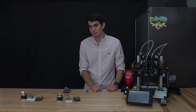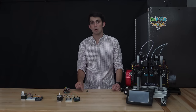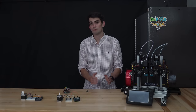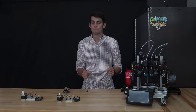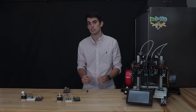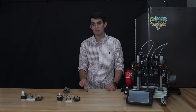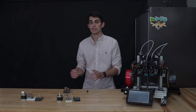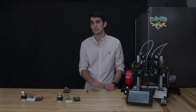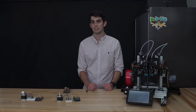Now, this may be a little bit confusing because I had previously said that there were little benefits to these small microsteps. However, the Trinamic stepper driver is performing this interpolation not for the purpose of increasing resolution, but to allow for smoother operation of the stepper motor. Plus, these calculations are done onboard the stepper driver, so this microstepping interpolation is not any more intensive than 1/16th microstepping for the microcontroller. I hope I didn't confuse you too much at the end of this section.